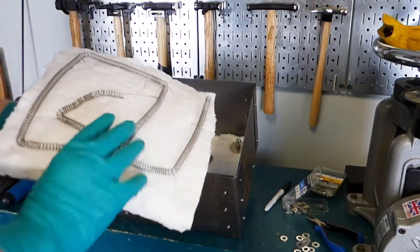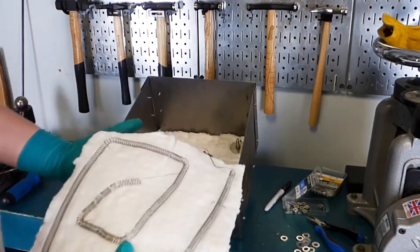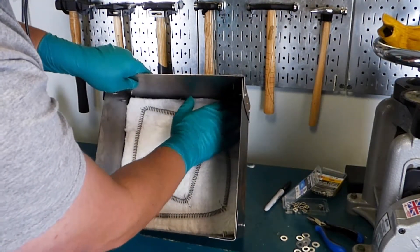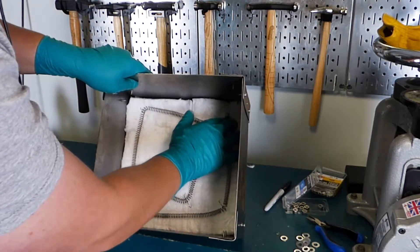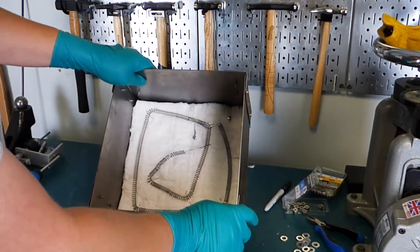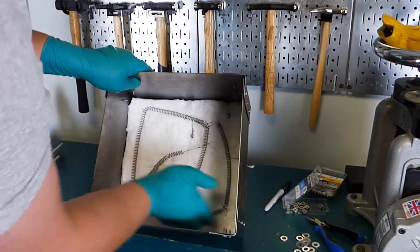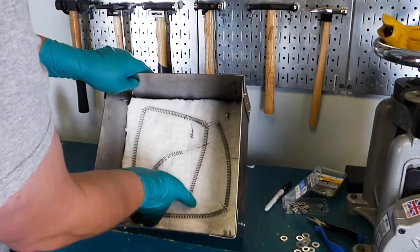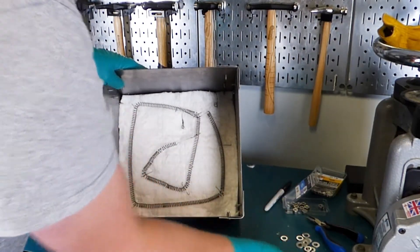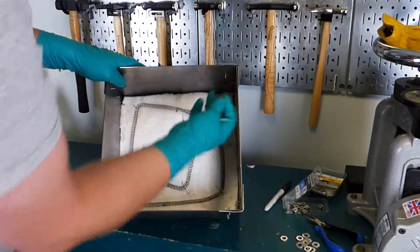I've attached the heating element using these homemade stainless steel staples, just folding them over on the back. I've got the slits cut in to where it should fit right in here pretty well, so the bolts are just barely poking through — I probably should have made them a little bit longer inside here. I was trying to do about 2 inches because I know this insulation is about an inch, and I probably should have done more, but lessons learned. Next we'll be putting bolts and these small washers to hold this in place.